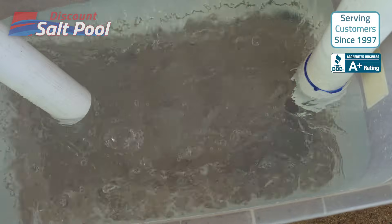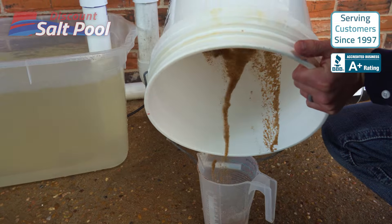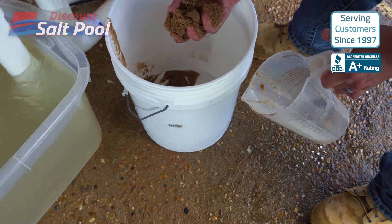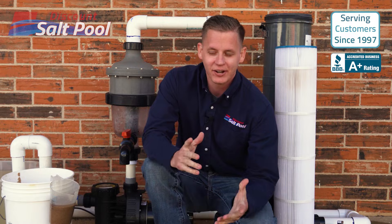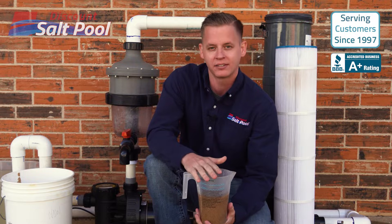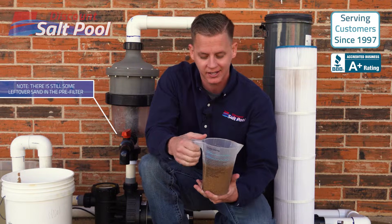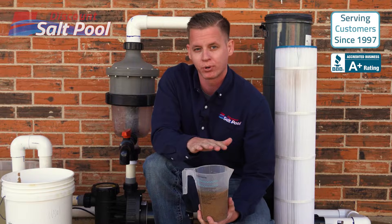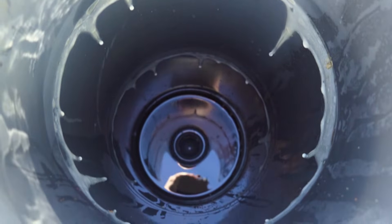After the main body of water started to turn clear, we decided it was time to shut everything down and check out the results. One thing I want to note is that we needed more water than we had to purge the valve — in other words, the tub we used was a little smaller than we needed, which meant we had to purge what we could and then estimate the amount of sand left over in the TJ16 pre-filter. Ok guys, so here we have all the sand that the TJ16 pre-filter collected. Now if you remember, we started with one full container — one liter of sand. After we purged the valve, which took seconds, we got just under three quarters.